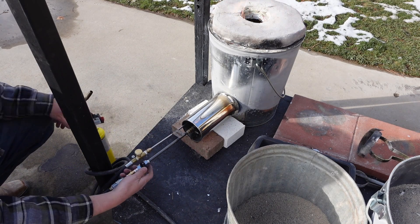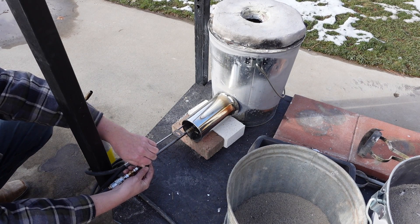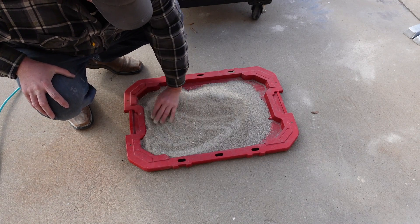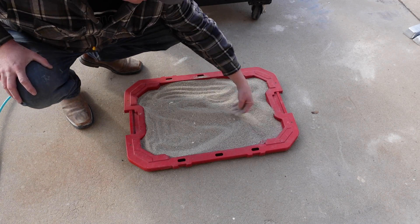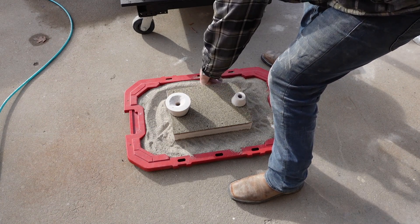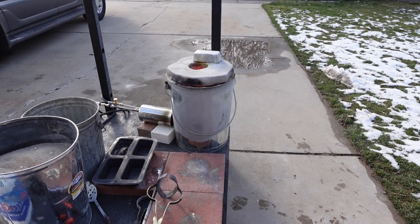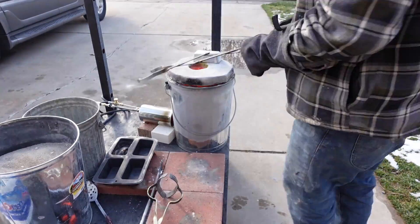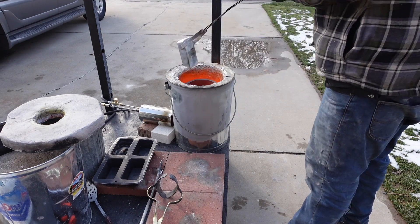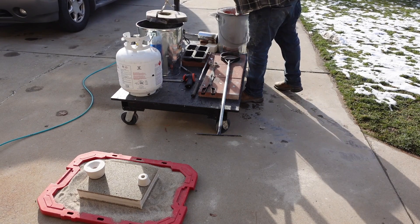Now it's time to start up my foundry — this is a homemade foundry I built using a burner from No Box 7. I'll leave a link for that burner in the description. The sand can I usually use was too small for this mold, so I'm laying some sand out as a place for the molten metal to go if it spills over the edge — and it actually did spill, so it was a good thing I had sand down to protect the concrete. I'm putting some ingots on the side of the furnace to warm them up. This is a zinc alloy similar to Zamac — a die-cast material. I'll show you where I get that in the next video.